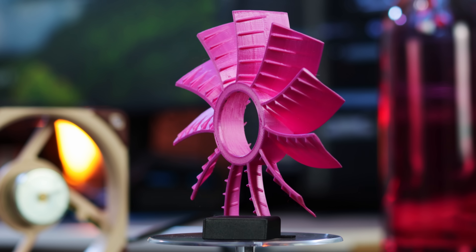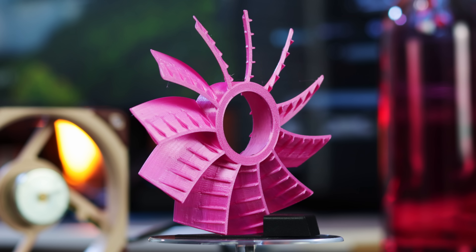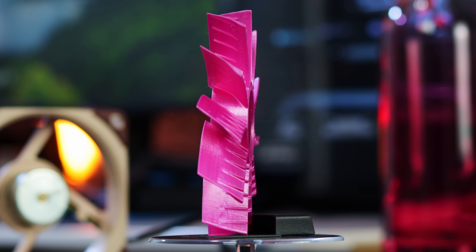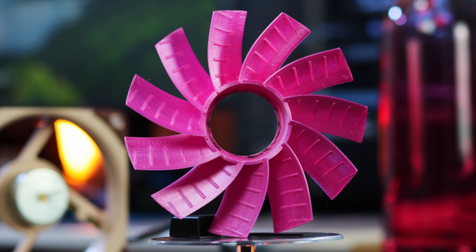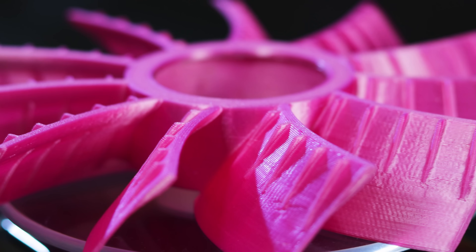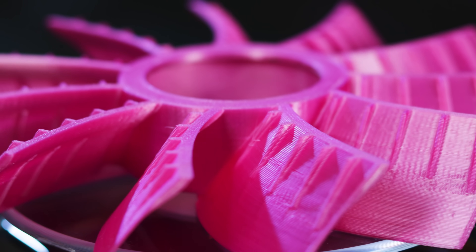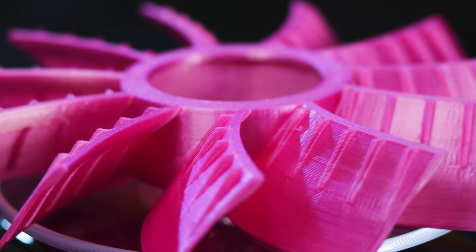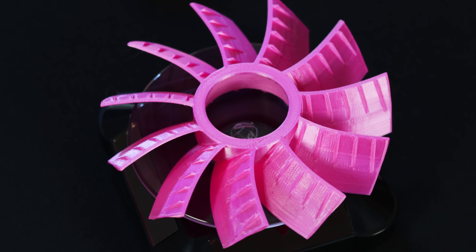I do have four fans we'll check out today. The first one is called the Simple Fan, made by Carl. It's pretty straightforward — 11 blades, standard configuration, forward swept, pretty thin. It looks like he does have an actual wing profile to it, and you've got vortex generators on both the bottom side and the top side. That's interesting because we tested vortex generators on the leading edge of the top side before, but not on the bottom. So although he calls it the Simple Fan, it's got some detail to it.